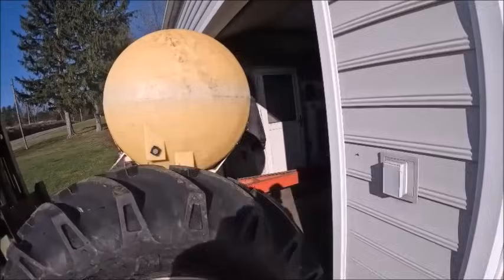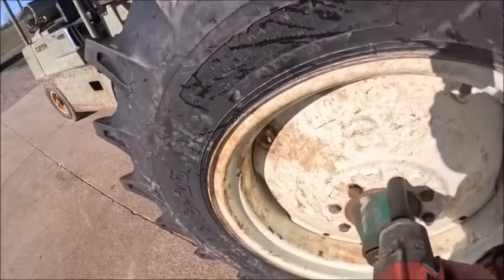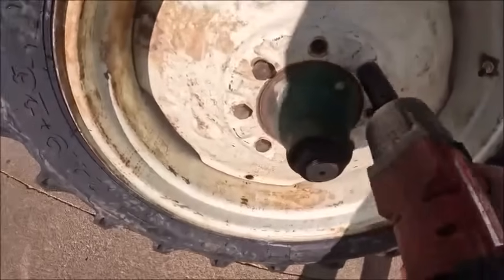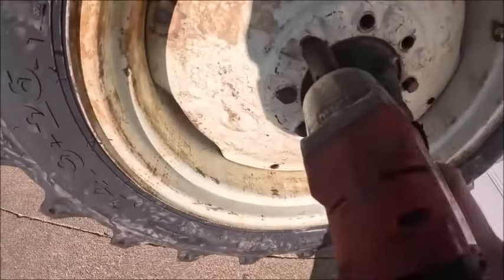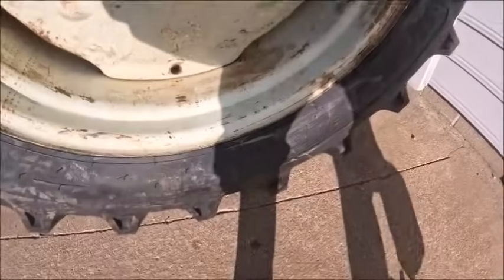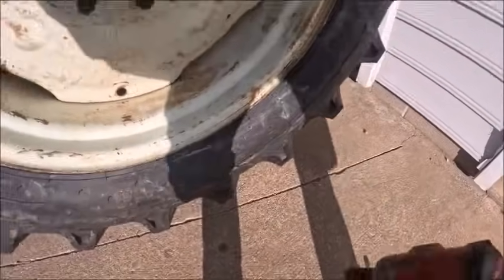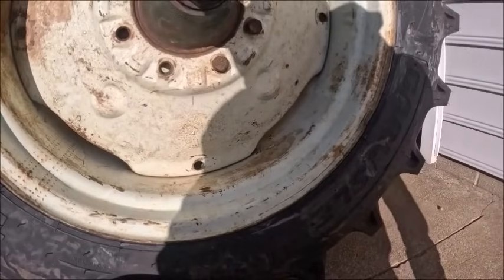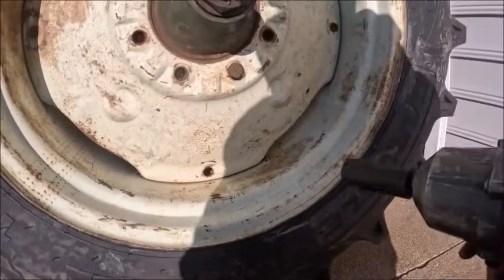All right, I was going to try to work on it like this, but there's just enough of a breeze kicking through that door that I'll never be able to do any welding on it. I figure since I got to take the wheels off to finish up the hubs anyhow, may as well just take them off and see if I can stuff this thing through the door. It's actually supposed to be a nice day out, but you still can't wire weld when it's windy out.